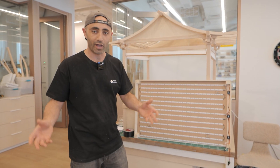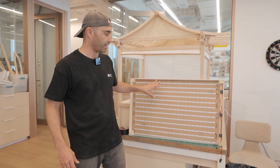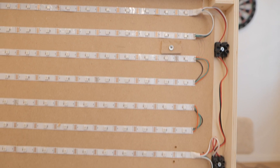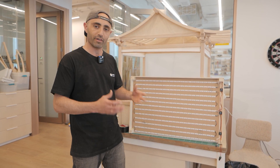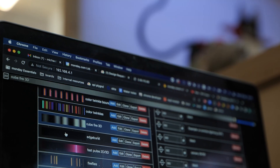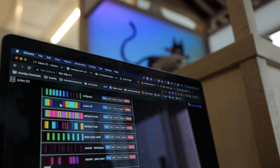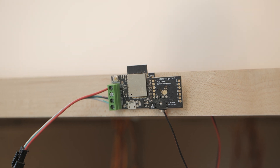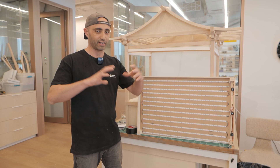We have a pagoda and a background, and we want the background to light up and be cool with sound-responsive LEDs. I put together a LED matrix — a simple screen of 22 by 13 pixels made out of strips of LEDs all connected serially. To avoid spending too much time coding effects, I found a component called Pixel Blaze, which takes sound and translates it into LED themes you can choose and even code. I connected an extra wire from the microcontroller to the Pixel Blaze to change themes on demand. For good diffusion so you don't see every pixel, I left about one inch — two and a half centimeters — between the LED and the acrylic background for a nice glow.